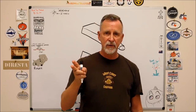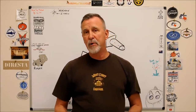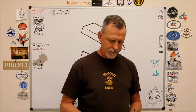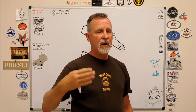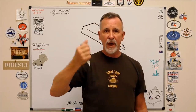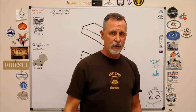I'm going to show you two different ways to do it. I'm going to do one in the lathe, and I'm going to do one on the mill. The mill technique is called back boring, and if any of the other YouTubers have covered this, forgive me. It's a very self-explanatory method. It's a method by which you turn the boring bar with the cutting edge to the inside of the track, and you come down with it, and you actually turn positive round features on a milling machine. It's pretty cool. If you've never seen it done, you're about to see it done.